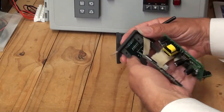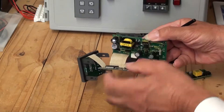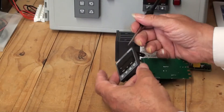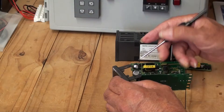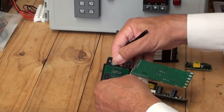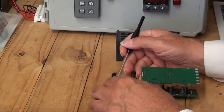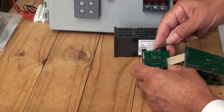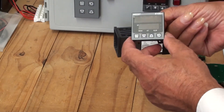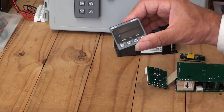With the front fascia, we can see it is connected to the CPU board by a ribbon cable. The CPU board and power supply board are also connected by ribbon cable. If the front of the controller gets damaged in any way it can easily be changed. Here we've got a couple of connecting lugs — you can just lift these up and it will come apart. We can remove this board and there's the front fascia, making it easy to replace just the front fascia if it's been damaged on site.